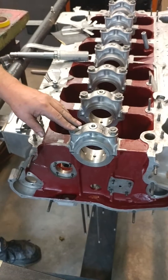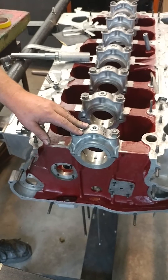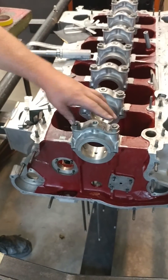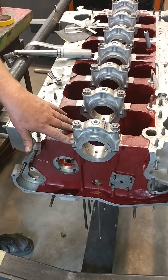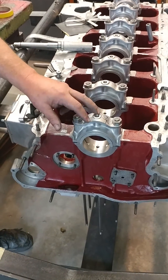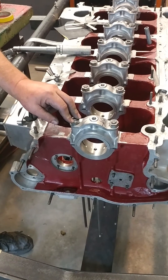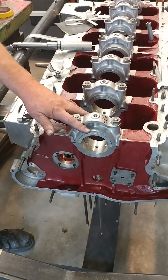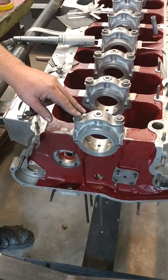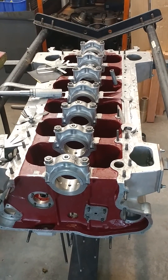Just to give you some time context: the cutting, numbering, setting shims, and rough setting is about an hour to an hour and a half per bearing. They are rough cut back to about twenty to thirty thousandths of crush, then fine set to get to three thousandths of crush. Because this is an extra-wide number one bearing versus the narrow intermediate bearings, it takes a little longer — this one took about an hour and a half to set to the absolute final crush. Crush will be checked one more time right before the engine goes in the line bore; we'll leave it sit for about a week to see if anything settles or stretches. It'll probably take about two solid days to do all seven bearings on a Phantom II.